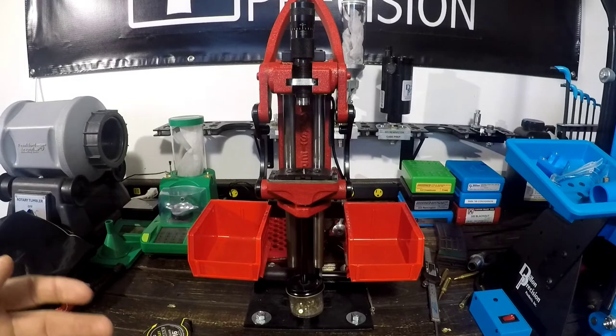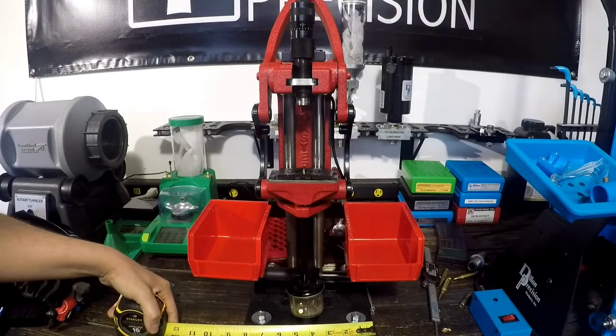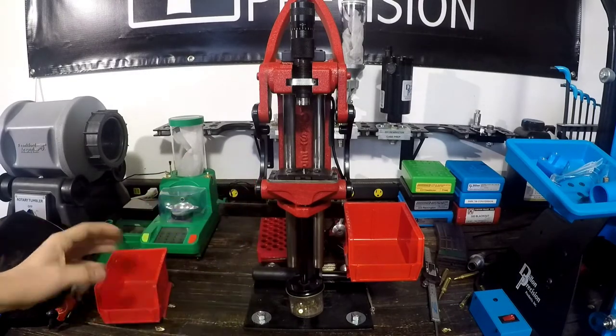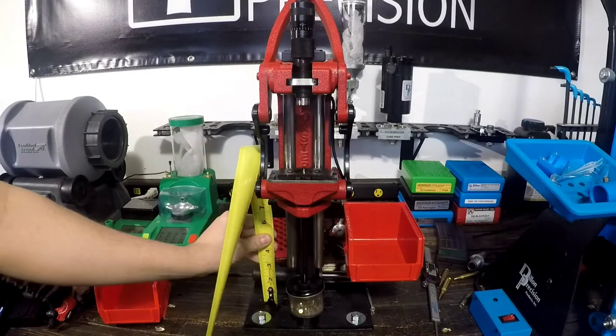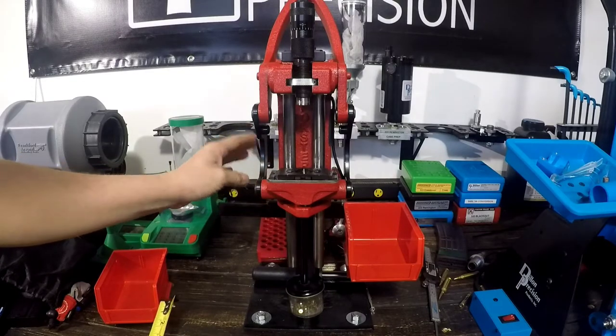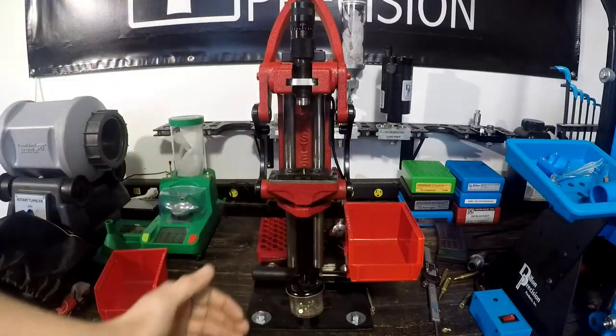A really popular mount you could commercially buy is the Inline Fabrication one. Dan over there makes really nice stuff — I'm not affiliated, just giving him a shout out. But I'm a welder by trade and have access to fab shop material, so I grabbed some stuff from the scrap bin at work. I got some quarter-inch plate, cut it eight by eight, punched holes one inch in from the corners, and got some one-inch square tubing cut to five and three-quarter inches. Then I got another quarter-inch plate and cut it four by four and a half as a rectangle so I could hang the press off a little bit.